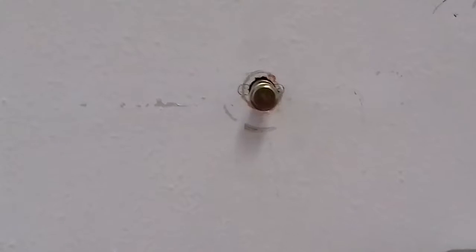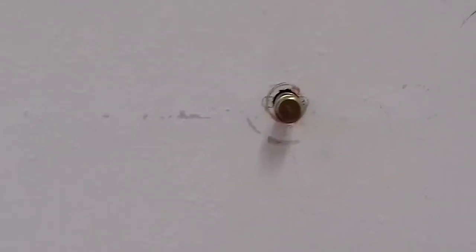And the other handy tip, number 2, with these bolts. Up here where this other bracket came from has got the same fittings in the wall. As I've just explained the way these work, if you were to screw your bolt back in and try to actually pull that out now, that fitting is in there really solid. You would have to get a big pair of wrenches on that and pull the hell out of it to have any chance of pulling that out, and then you'll probably pull that massive chunk of plaster off as you rip it out. But like everything, simple when you know how.